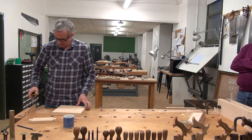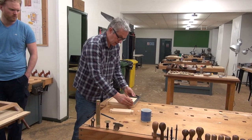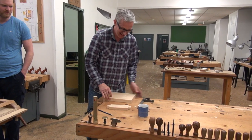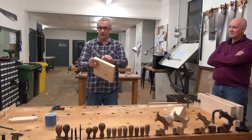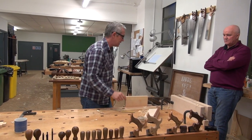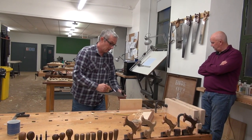If you really want to impress your friends, you can just take that line down like so. Don't take that line all the way around — we're just going to plane down to that and check with the square to make sure it's really good. Pop that in there and get the plane moving, and we're going to do it as before.